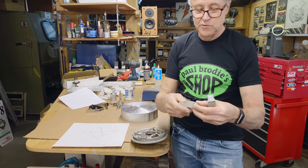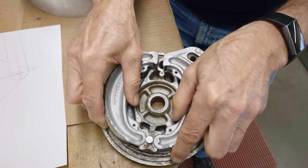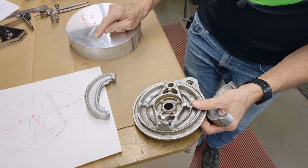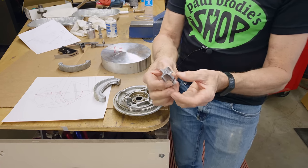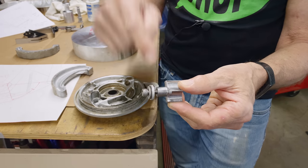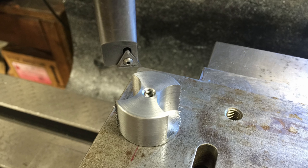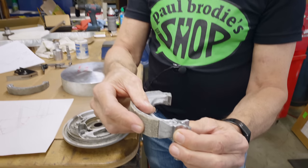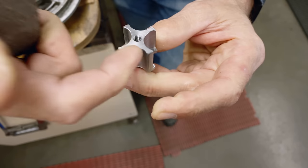You see how this works? These are the brake shoes and they fit into here. If I had this piece as part of this, I'd be starting with a piece that's maybe close to three inches thick — that's just a waste of metal. So yesterday I made this up. I took some cold rolled, machined it down to half an inch — 499 thou — then I reamed a hole so I knew the center, locked that into the plate, and used the boring bar to cut these because they have to be an exact size. I experimented on a piece of metal first so it's a pretty good fit. Then I cut these to make it lighter.